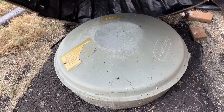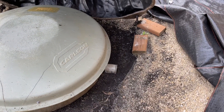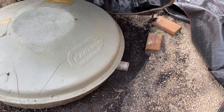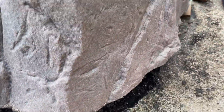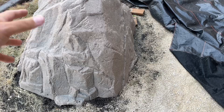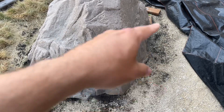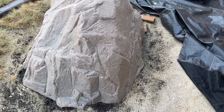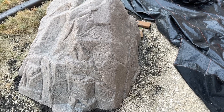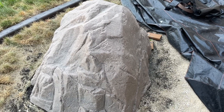With a septic tank - oh, that's a lovely stench. Anyways, I found out that it has a pump in there. Problem with that is the access to get the wires and everything else is kind of onto the ground and I need to fix that up. So we're going to build basically a little tray that's going to go around that octagonal lid. I'm going to dig down very carefully, get it all set out so it'll sit down on the ground, pull the dirt away from that area so we can get at it if we need to. The rocks can come up to the edge of it, and this will sit on top so we'll never know there's a septic tank underneath there, but when they need to service it and pump it out it'll be easy to get at as well.